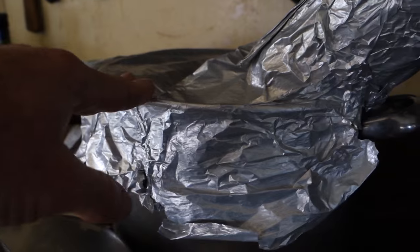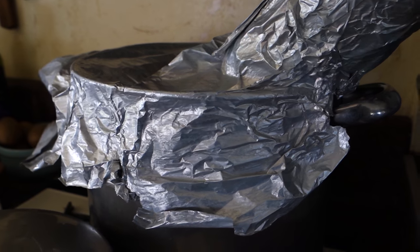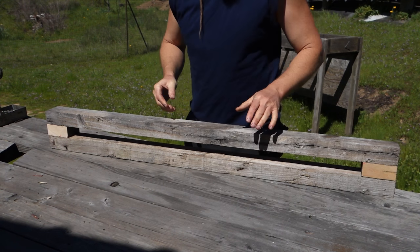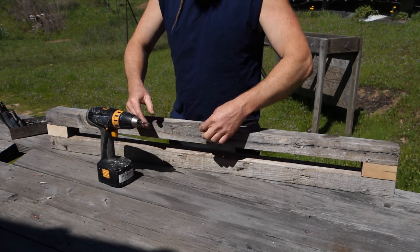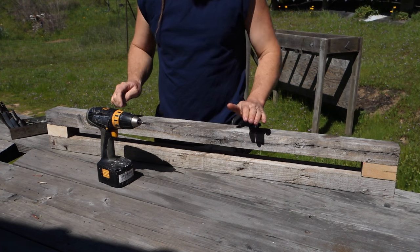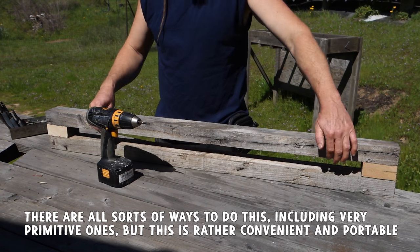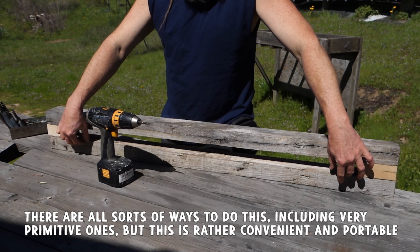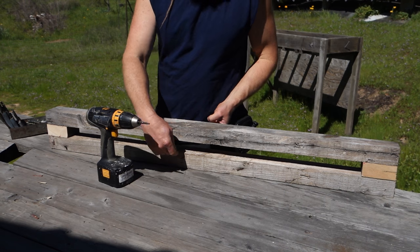Real simple — it doesn't have to be complicated at all. Remember that the axe handle is already soaked in water, so all I really have to do is penetrate it all the way with heat. So I'm whipping up this handle jig here. The idea is if I put the axe inside here, I have two straight parallel lines that I can use to visually see if the handle is straight or not. I can move the handle either direction as much as I want, wedge the whole axe in here, and then use little shims and wedges to get the handle exactly how I want it centered.